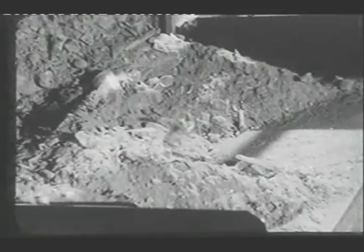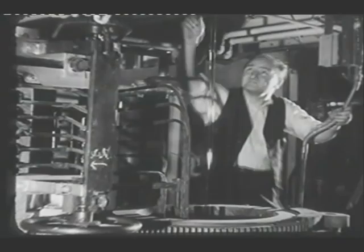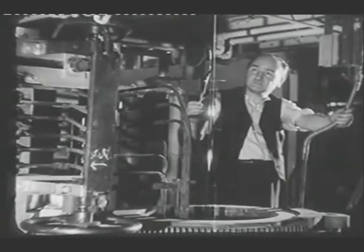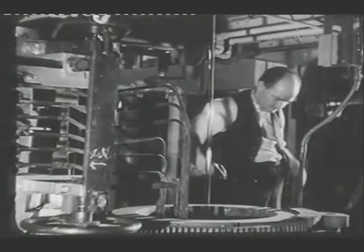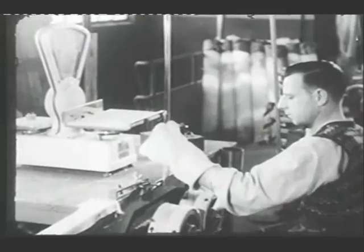Here are the raw materials of glass: sand, red lead, soda, and a proportion of broken glass, technically known as cullet, which are melted together in the glass furnace. Many of the glass parts used in valve manufacture are made from glass tubing. From the tube-making machine, a column of molten glass is drawn upwards, an internal blast of air keeping the glass in tubular form and controlling its diameter. As it ascends, external air streams cool it and control the thickness of the wall. The now solid tube is cut to standard lengths and each length is gauged and weighed to check its dimensions.